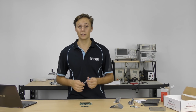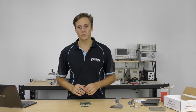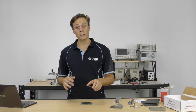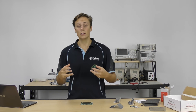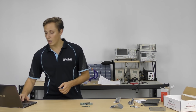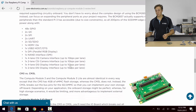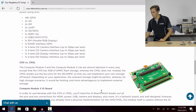Another advantage is the supporting circuitry and peripherals. The Compute Module has all that supporting circuitry on board — once inserted into the correct adapter with power applied to the correct pins, it has everything needed for the chip to work correctly. The IO board just expands all those pins into a usable form. You also get 48 GPIO pins — more than on a standard Pi board due to its size — plus HDMI, SD, UART, and so on.